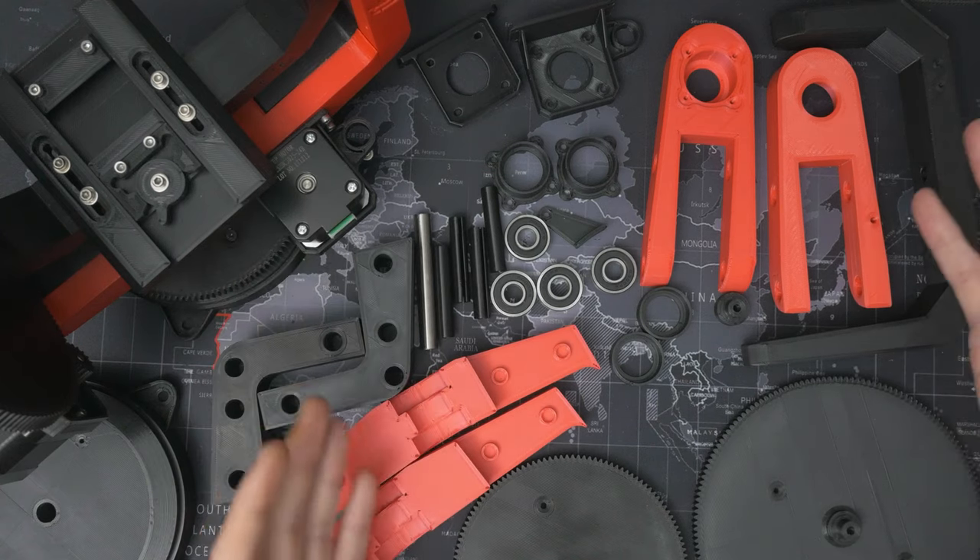It's the next morning and the epoxy is all set, so let's get these clamps off and see how much we've got to clean up. There's a little bit of squeeze-out but I think we can scrape it off just fine. The trick with the epoxy - even though it's supposedly five minutes - is to catch it at just the right time when it's still soft enough that you can clean it off with a knife, so that's what we're going to do.